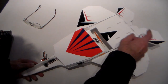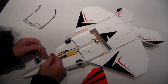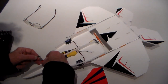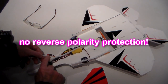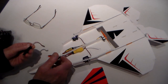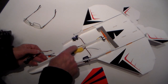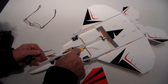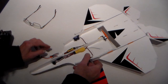I had a little minor disaster — I made a plug to connect the battery but it wasn't very well marked at the time. I plugged it in the wrong way and the battery got intensely hot in five seconds. I unplugged it quickly, but afterwards the receiver wouldn't connect. I thought the speed controller and receiver might have been damaged. As it happened I managed to get it going again — I had to rebind the receiver, which had been knocked out, but there was nothing wrong with the speed controller. Big lesson: never be in too much of a hurry.